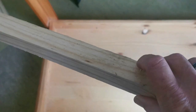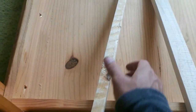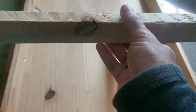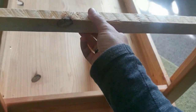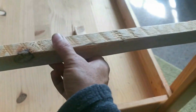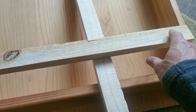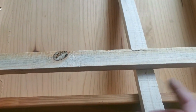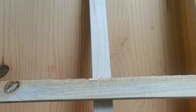So let me just go and sand off those two pieces to get the rough edge off, and then we'll come into doing it. Okay, I've sanded off those planks a bit to make it smooth. Now we're going to find the halfway mark and insert them here between the two legs — that should definitely make a big difference. I'm going to get my drill to make two little pilot holes, and my level so we can make sure it's going to be level.